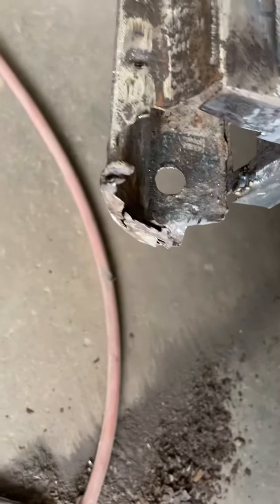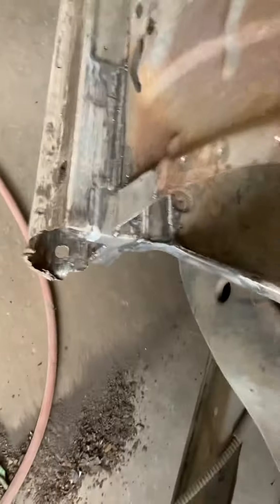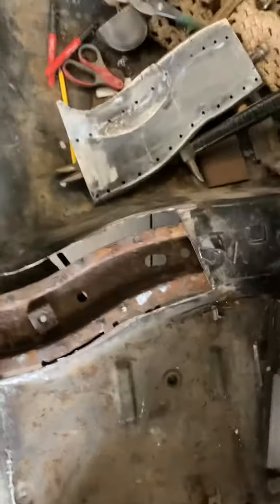It's still coming along though. I'll get that tub in there, then I can make a piece for the end of the rocker — that's rotten — and then I'll sandblast in here a little bit before I weld that quarter on. There's a bit of rust on the edge here that'll come out later once I get that quarter on, so I've got to sandblast and clean it up and paint it before we put that quarter on.